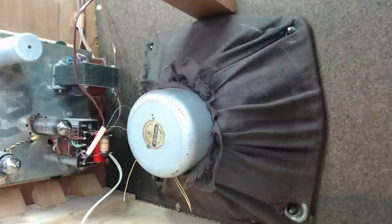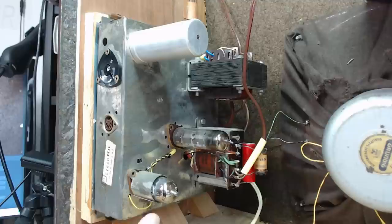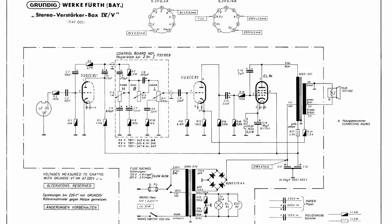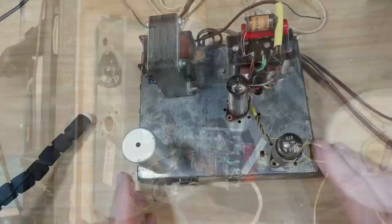I'm at my workbench with the back off it. It has two speakers - that one looks maybe 10 inch and there's another little mid-range up the top. Over on the side is the amplifier: an ECC83 and an EL84 I think. After a lot of searching I found a schematic - not exactly the right one but I think it'll be identical. The gentleman that owns this bought it on a marketplace and he said it blew a fuse.